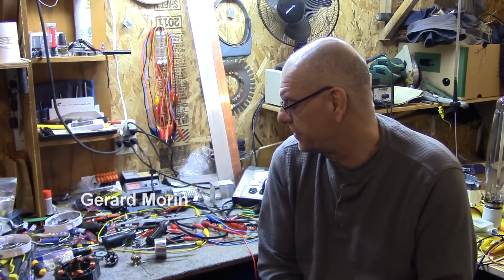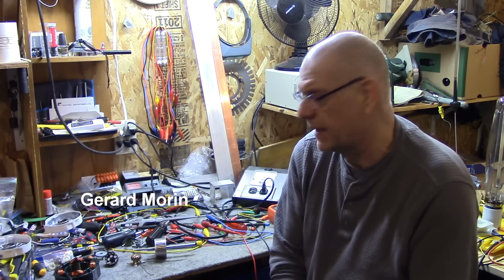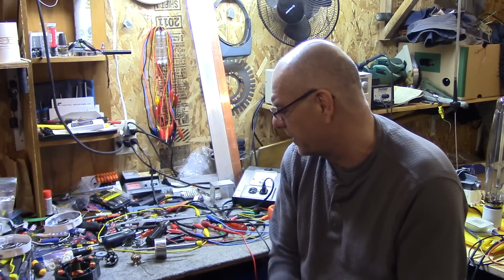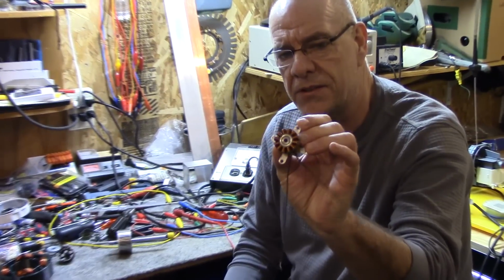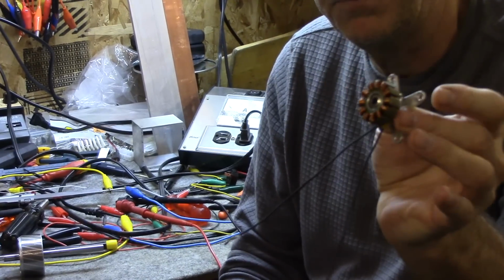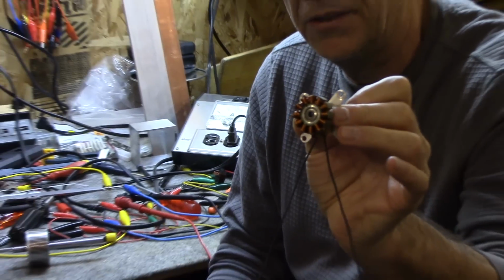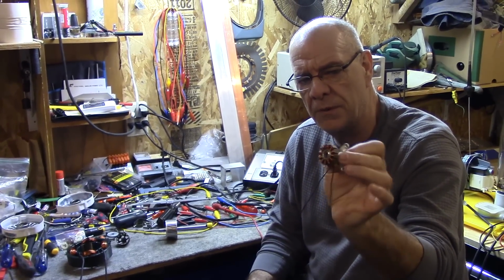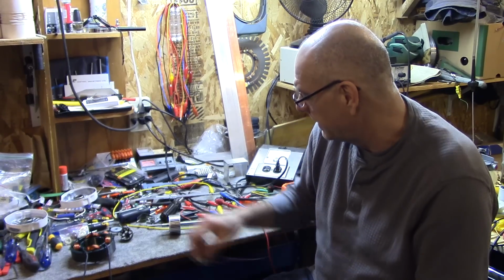Today we're probably going to do a quick video to give you a little update on another generator I'm putting together, slightly bigger than the last one, since we had pretty good success with the first one with that tiny little guy. I don't know if you guys really remember that. That thing was topping out at 10 amp at 26 volt, and at constant run at 5 to 5.5 amp, it was no problem with that little thing. It was barely coming up to normal working temperature.